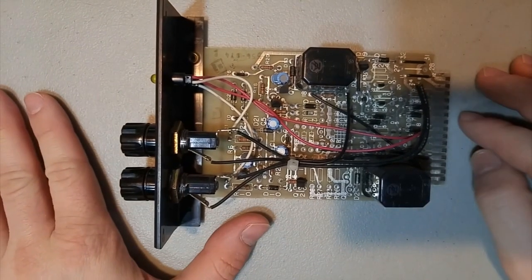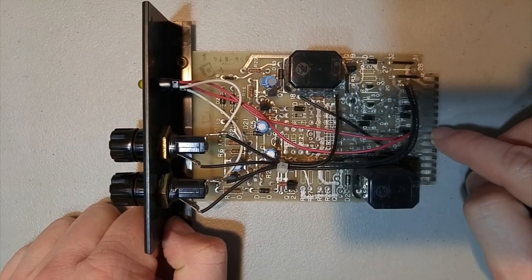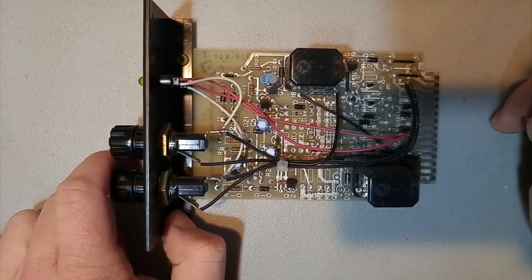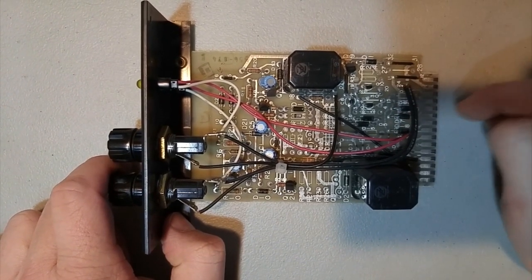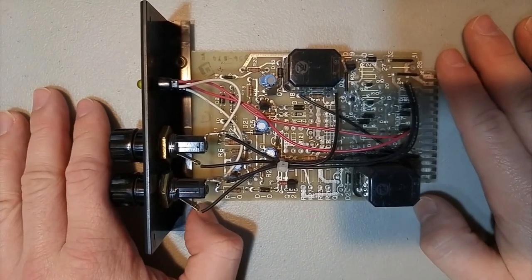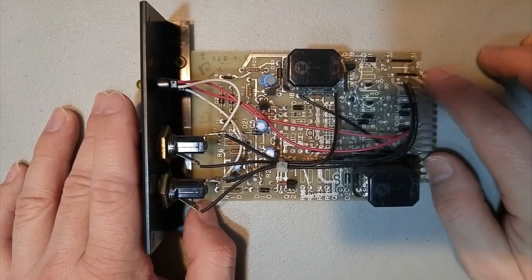Now the way the signal circuit cards work is that some of these terminals, they might be on the other side, I don't remember which side, but that's a bit too specific for this description. But anyway, some of these terminals are what's called the PIC terminals. The manual calls them picking, but I'll just call them activating. Basically, when you apply power to the terminal, it activates that particular NAC. If you apply power to one of the terminals, it'll turn on the relay for NAC 1. You apply power to the other terminal, it'll turn on the relay for NAC 2. In the way my system is wired, the march time card's output is connected to NAC 1 and NAC 2, so that as the march time card pulses, it turns these relays on and off.